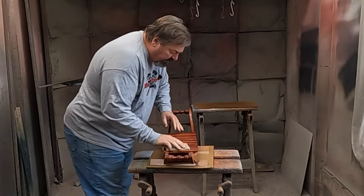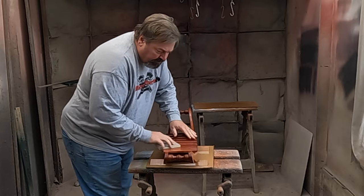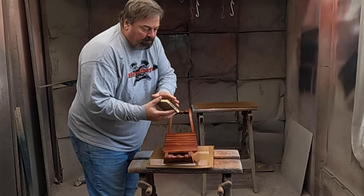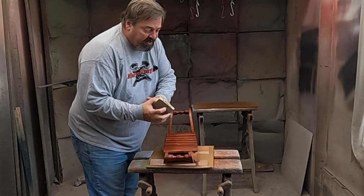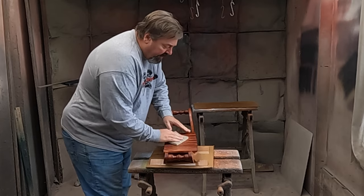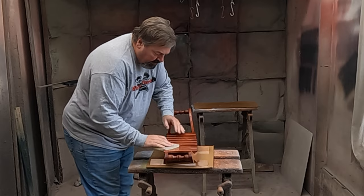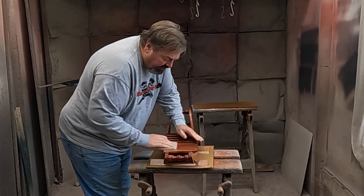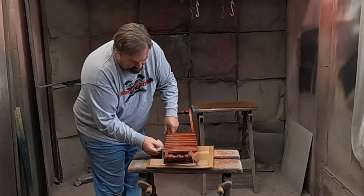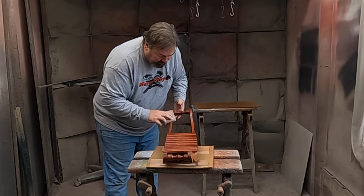Third and final coat on our little rockers. Now I'm sanding down with, this is a well-used 120 sanding pad. I'll use either these or I even have 220 sanding pads. Again, from Klingspor. And I'll just lightly sand everything and then we'll hit it again for the last time. And then we can bring our little thoroughbred in.